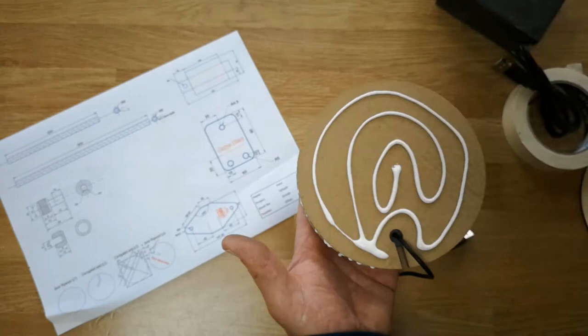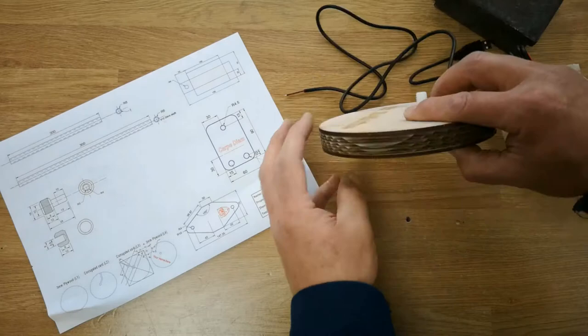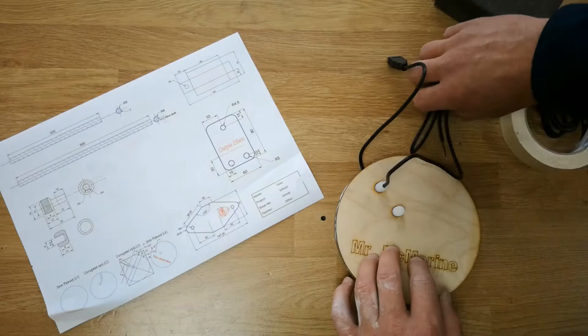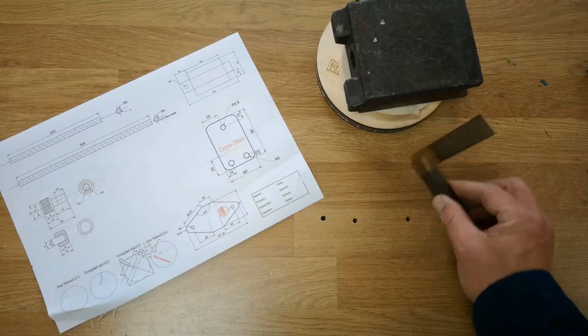Place it on the table, add the masking tape between the two bolts, then the weight on top of the masking tape. Now is a good time to use the engineer's square just to make sure that all the layers are in line as much as possible. If they're a little bit off it doesn't matter because we can neaten this up later on.